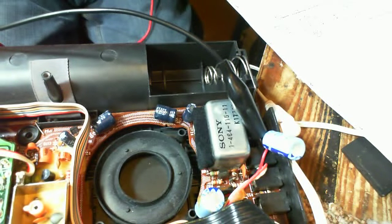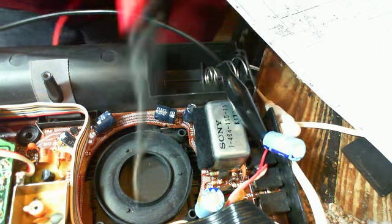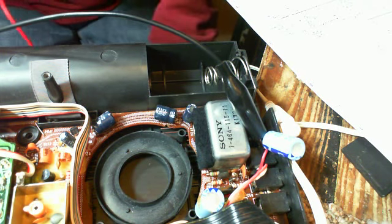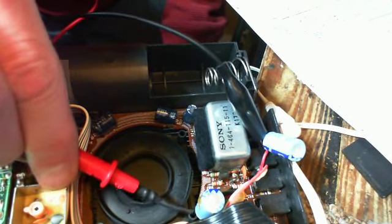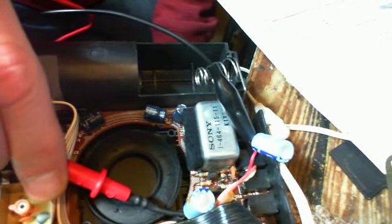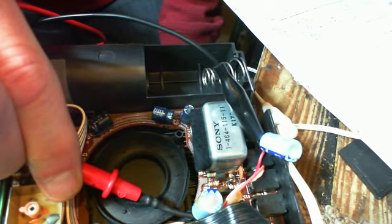My camera is fairly flexible, you know. I get to kind of mount it in all kinds of different ways, but it still has its limits. Okay. So here's the capacitor I'm using to find the ground. There's the ground clip right here on it. But now I want to try to read the voltage on this other capacitor here. You hear a little click in the speaker when I was doing this. There we are, 5.6.